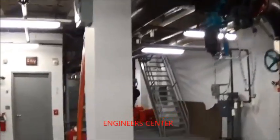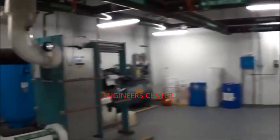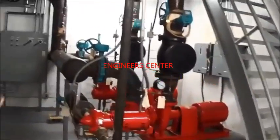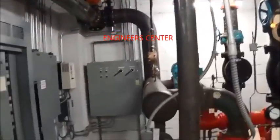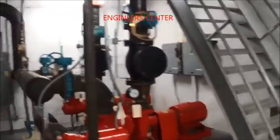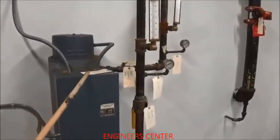This is a water-side condensing chiller plant and it requires a lot of maintenance. As you can see, this one is kept immaculate — the crew does a great job here. You do have to attend to your chiller plant pretty much three or four times a day. Here comes the warm water in the condensing loop — it goes to these pumps and then leads outside to a cooling tower. The cooling tower is a large reservoir with fans at the top that reject the heat into the atmosphere.